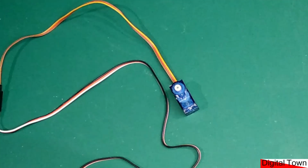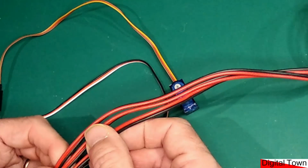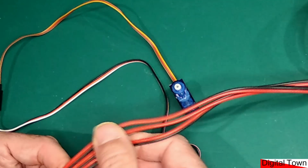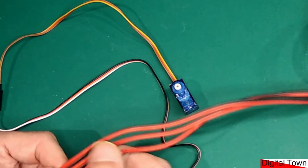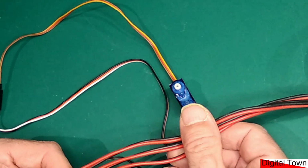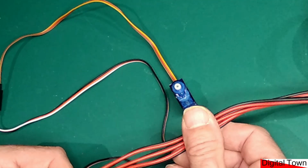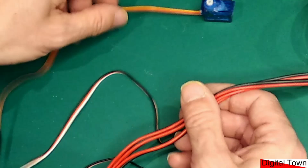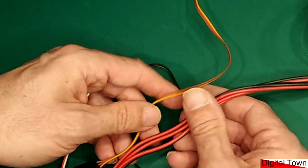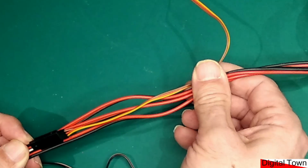Now, on my model railway, I use DCC control. And my wiring works like this: I use these twin wires, and through here is running about 12 to 14 volts, and it's running a square wave. So think about it almost like AC current, but instead of a smooth curve, it is a jagged sort of square wave. And one of the things you tend to do when you're building your model railway, you like all your cables running nicely. So I've got my servo controlling something, and then I strap this cable alongside these wires.